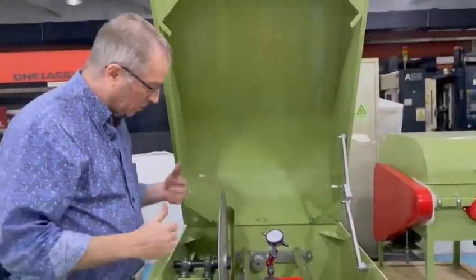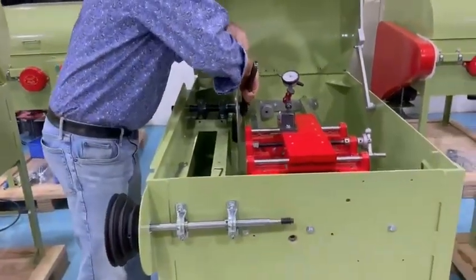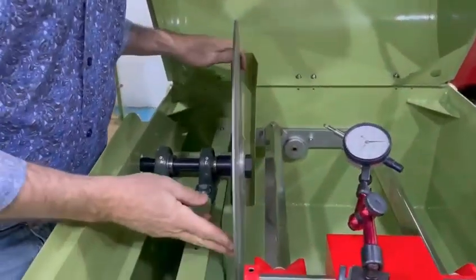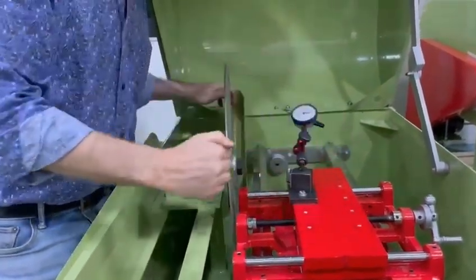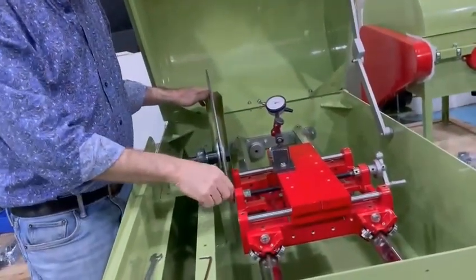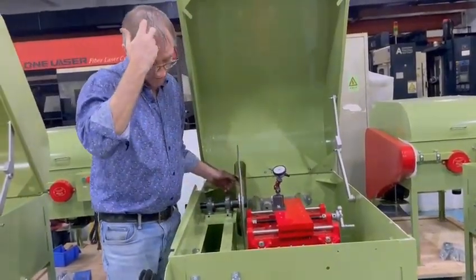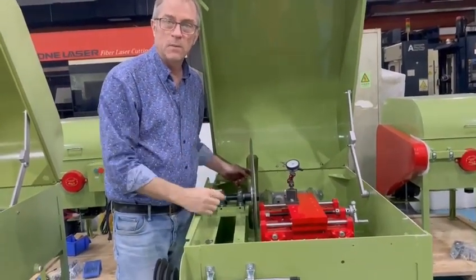If you're getting wedge-shaped slabs, let me talk about blade alignment. If your arbor is out of alignment this way and you start cutting, what happens is it starts pulling the blade in further and further, which means it's trying to dig into the rock. It may actually pull the blade into the edge of the carriage or the vice — that's a really bad situation, because it actually starts to deform the blade permanently. This is what we call dishing.